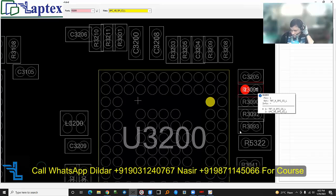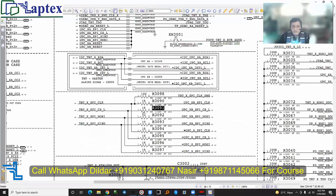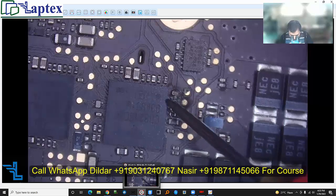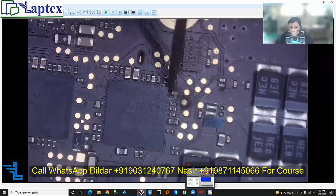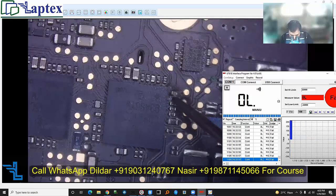The SPI area of the C-type IC appears faulty. The resistor is R3091, which is 15 ohm. In order to carry out SPI communication, it requires chip select, data in, data out, and clock — all passed across a very small resistance, usually between 10 ohm and 45 ohm in the path. Let's check whether the 15 ohm value is available. The capacitors are all right, but the resistor value is moving — it's unreliable.